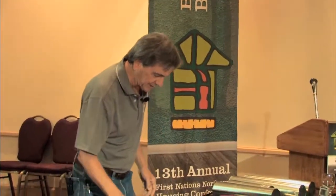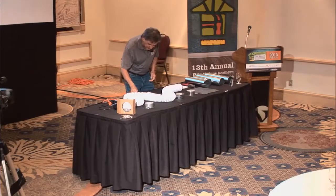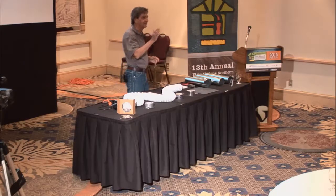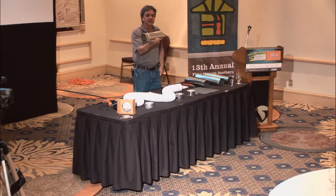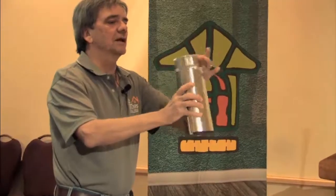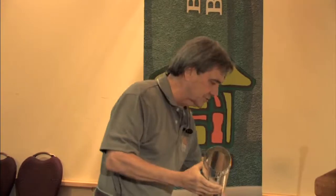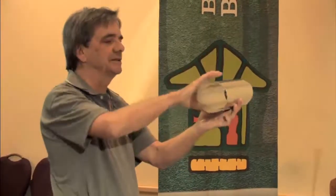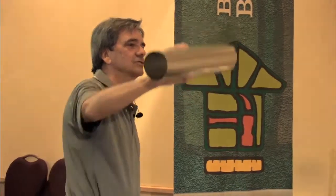And sometimes the whistle comes from just two pieces poorly joined together. And we've got air sneaking out through that joint. And somewhere along the line, it just hit that harmonic, and you get a whistle. And you're trying to figure out where it is, and a little tape, and the whistle goes away. So you do need to work hard at that. I just realized as I picked that up that I had another little demonstration I wanted to show you here. Well, let's just finish up on this noise. The speed of the air, the shape of the grill, and the distance from the fan is what deals a lot with those noise things.